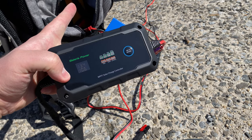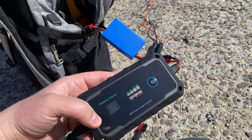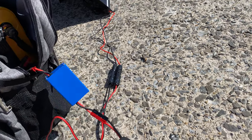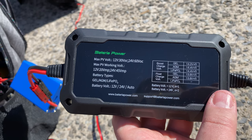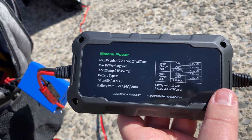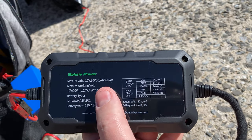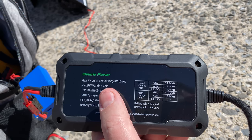The ideal goal is that the panel voltage is higher than the battery voltage. If the panel voltage was lower than the battery voltage — say 12 volts while the battery is at 13.4 volts — it might not even charge. This controller can do up to 30 volts for a 12-volt system, and this panel's 23.5-volt open circuit is fine. Most 200-watt panels are actually rated at a maximum of 30 volts.